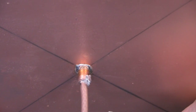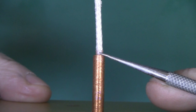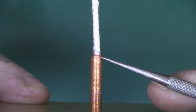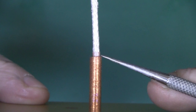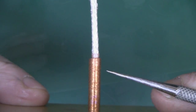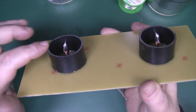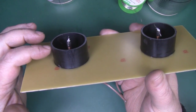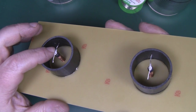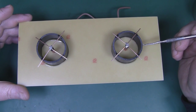I'm going to put some heat shrink tubing over the top just to protect it. The coax comes out from the opposite side of the tube, and I've left about one millimeter of the outer insulator in place to make sure the braid doesn't touch the top. I'll put a small piece of heat shrink there too so there's no danger of contact at the top of the tube. I've epoxied the tube supports in place to hold the element legs at the correct distance away from the reflector, and prepared the coax ready to solder the element legs.